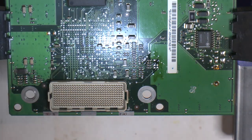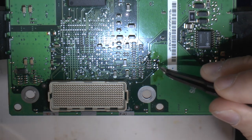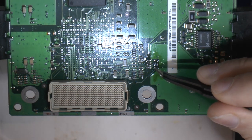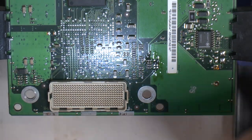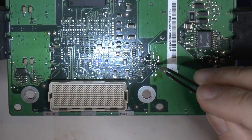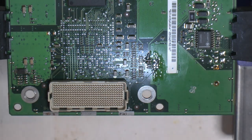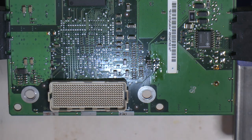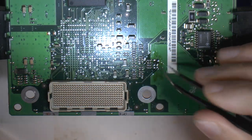So, the way this usually works is that this wire here, this trace, is all the ground here. And these are the multipliers, so... 1K resistor over here, and these will pull it down to ground. And those resistors are like 1,000 ohms, so 1K. So we need to add one here and one here.